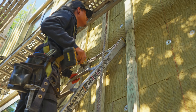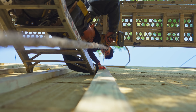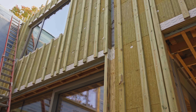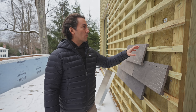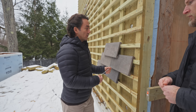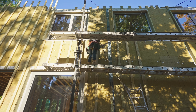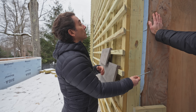One question that came up is that with a screw protruding out like that, there's a lot of shear — a lot of bending force on that screw. Number one, you have them every 12 inches, so to bend multiple screws would be very difficult. On top of that, when you're compressing against the rock wool Comfort Board, you're actually creating a really rigid structure which supports the weight. The rock wool is sufficient because of the spacing of the strapping. These screws are engineered to go in at a slight angle — they're in tension, which is what the screw wants to do when the threads grab the studs. Between the friction along the facade and that tension through the screw, this is really stable.